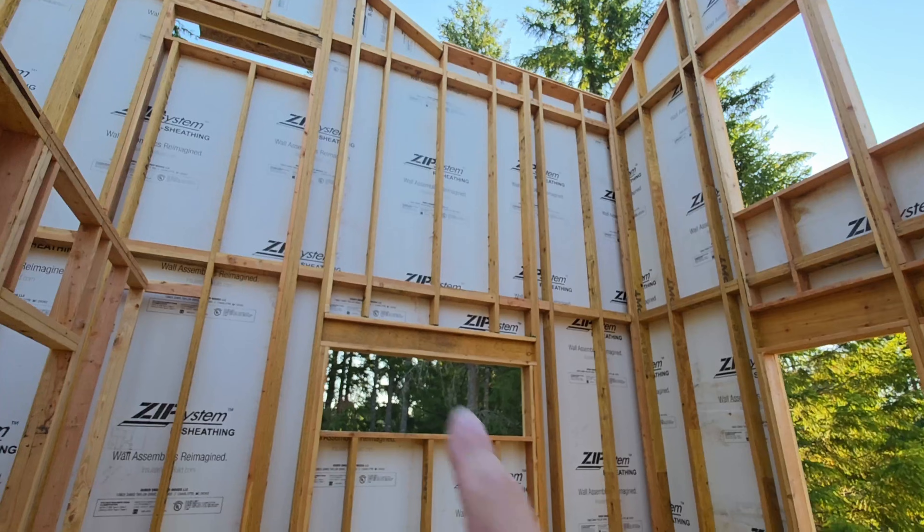How do you do a floor system when you have balloon framed walls? We're going to frame it like a deck — the floor is going to hang off ledgers. We're going to attach LVL to the walls with Strong-Tie SDWS timber screws. Decks have higher loads than floor systems by quite a fair amount, so it's all an engineer design.